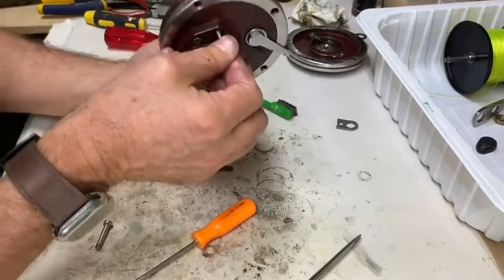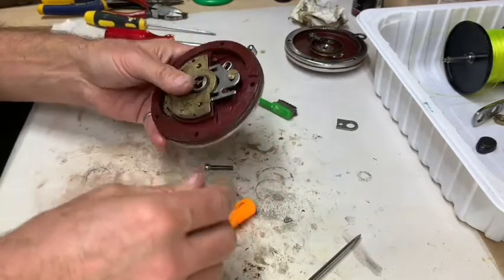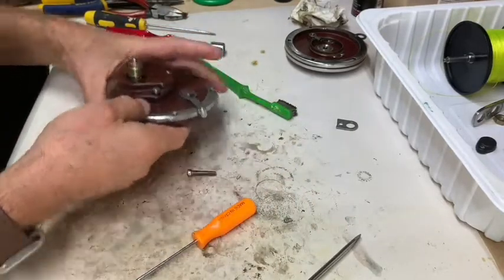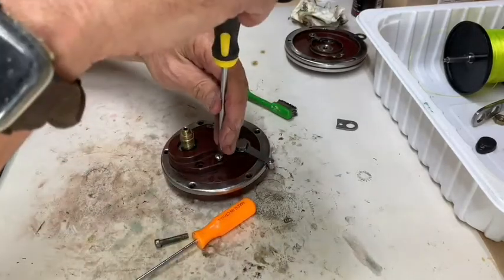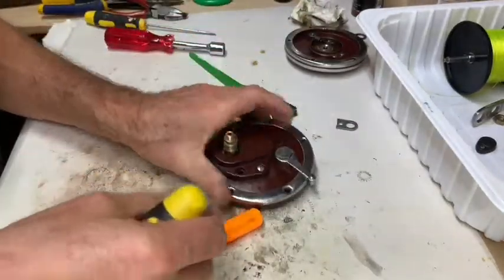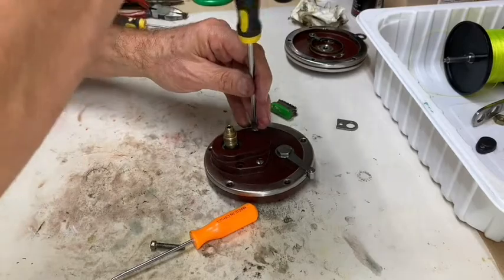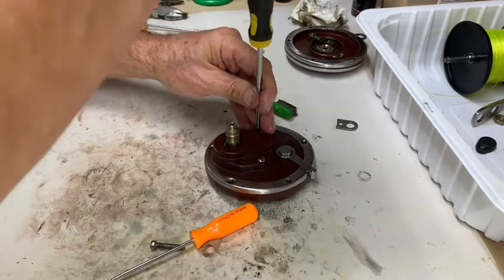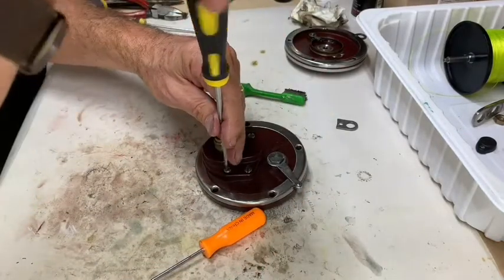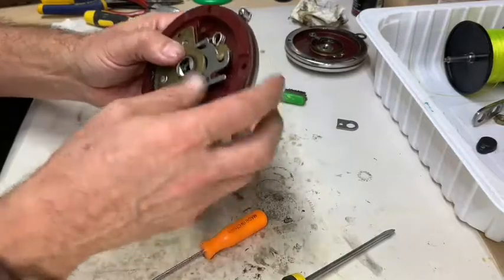So in the event that some of the yoke screws fell out, we can put those back in. Those are the shoulder screws. Let's get those on. Turn this back over. Get those all started. Here's another shoulder screw where the yoke spring goes. It started. And then this other one's kind of a freebie. All right, so they're not all driven home, but they're all there.